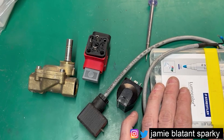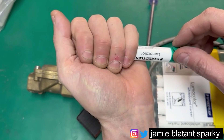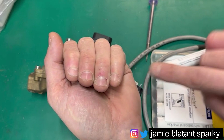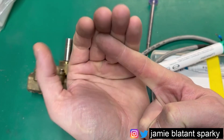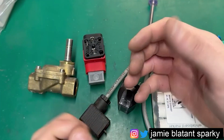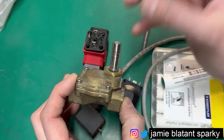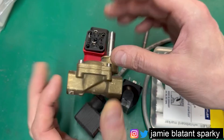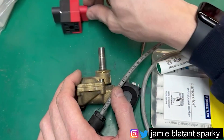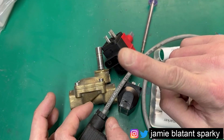It's just doing this: it's enclosed, and you want this to go up and down, so they put a ferrous bit of metal here, apply a current around it and it will move. What's in here is completely separate from outside. So if you're using high-pressure gases you can switch it - one, it's flame-safe, and two, without any massive moving parts or stuffing boxes or seals. And that is what I know about solenoids. If you know about these types of plugs, how they work, and that these test devices are available, you pretty much know what I know.